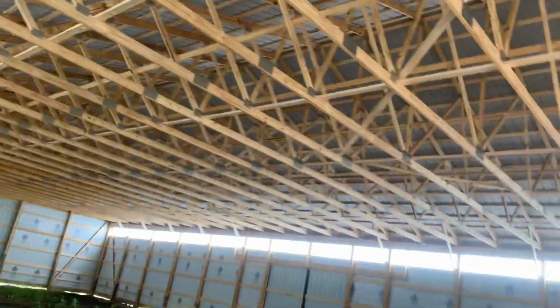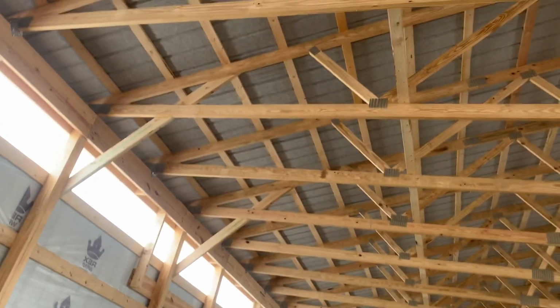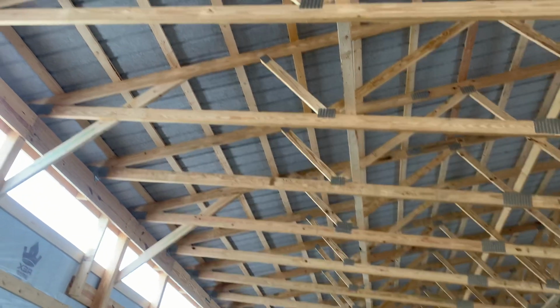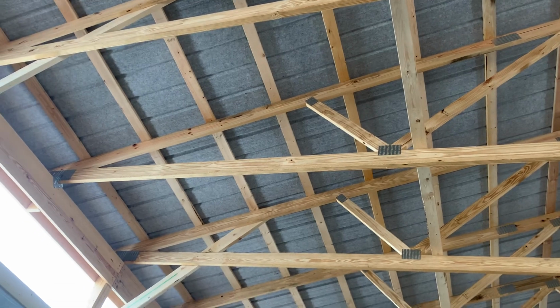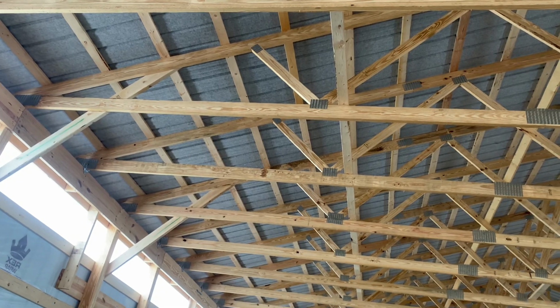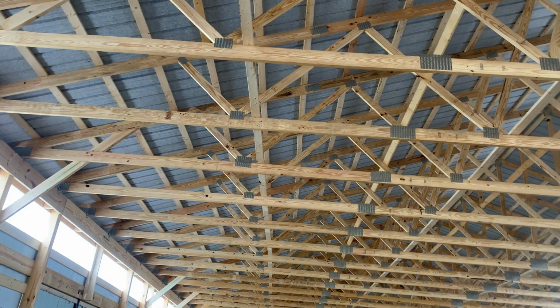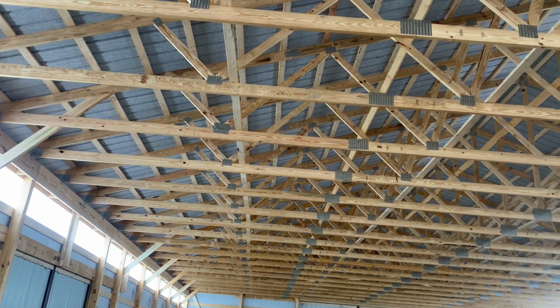All right. And then on the roof, this is kind of, I wouldn't say a new concept out there. We're a little muddy in here as I walk around, but this is drip stop on the roof. And again, that's approved for animal confinement. Now he's gonna have horses in here, obviously not cattle or hogs or anything like that, but there is a 20-year warranty on that. You can see it has this felt on there, and it can be pressure washed, it can be cleaned, as you get cobwebs over the years, you can pressure wash, you can knock that down and so forth.